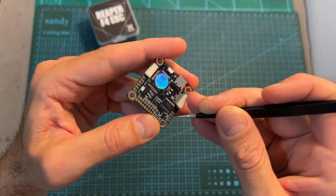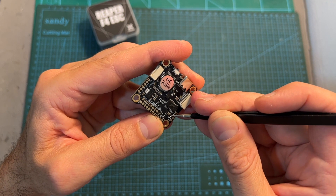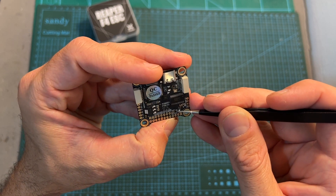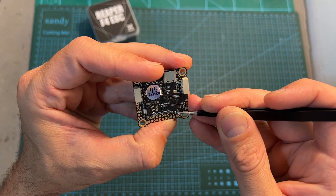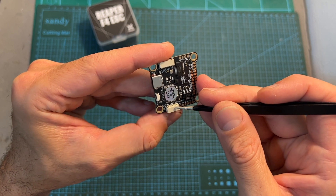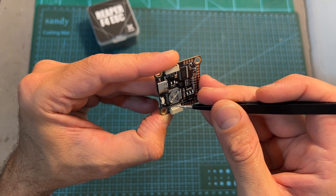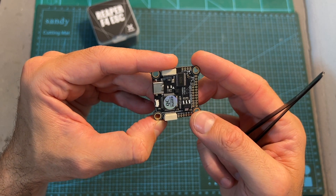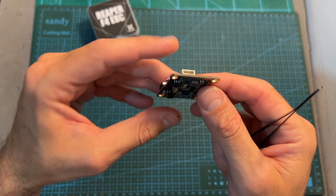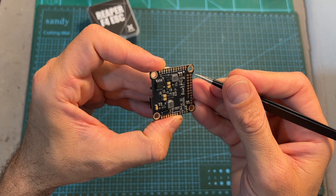For example, in case you would like to supply the camera with 9 volts, you will need to desolder the center pad from the left one and bridge the center pad with the right one. Similarly, you can change the voltage of the VTX from 9 volts to 5 volts. In case you are going to use a digital VTX using the JST connector, it is going to be provided with 9 volts. In addition, if you would like to use this flight controller on an X8 setup, it's possible but you will need to remap some of the outputs using the CLI command in Betaflight in order to use the four extra motors.